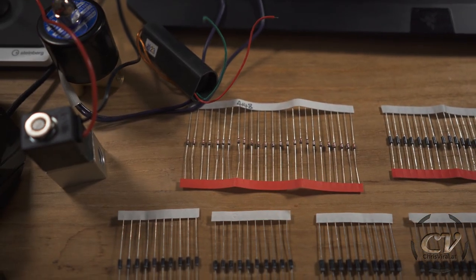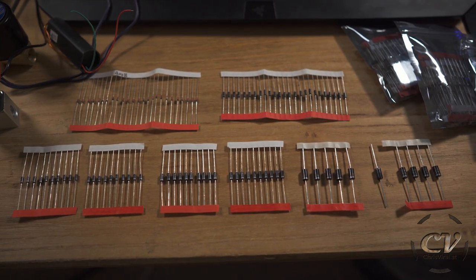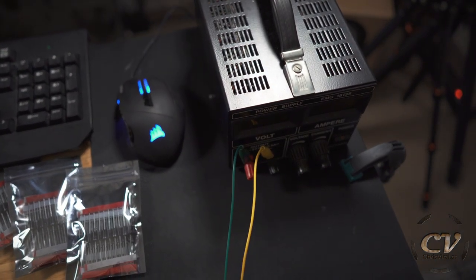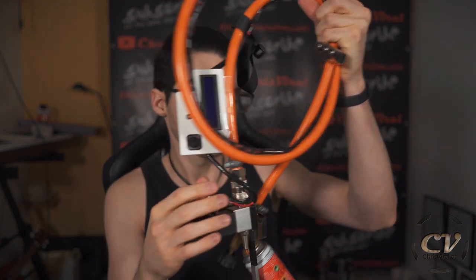If you want to know more about that, check out this vlog — it also has a coil in it. I got myself four packs of diodes; one of them was like one or two dollars, so I probably never have to buy diodes again. I'll use this power supply for the 12 volts we need. The flame fist features a solenoid valve and a high voltage module — check out the last vlog for more. Implementing flyback diodes might solve a few problems, because there are actually quite a few problems with the flame fist, and back EMF might be one of the reasons the electronics sometimes black out. So let's power it up — 12 volts — and I'll use a big solenoid valve for demonstration because the spark is super potent with this one.